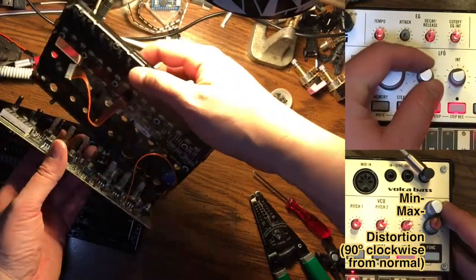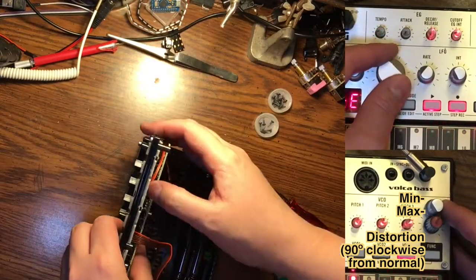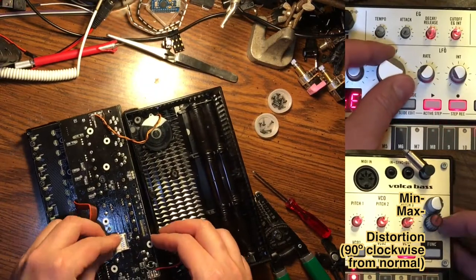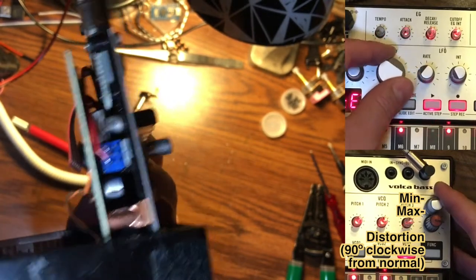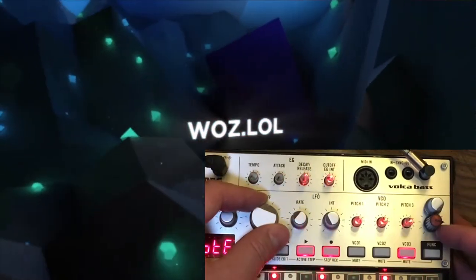This is R164. It's a 103-marked resistor — that's a 10K resistor. Use a 10K pot. When we short that resistor out, more volume goes to the final amplification stage, which is a MOSFET in this unit, and MOSFETs distort really good sounding.